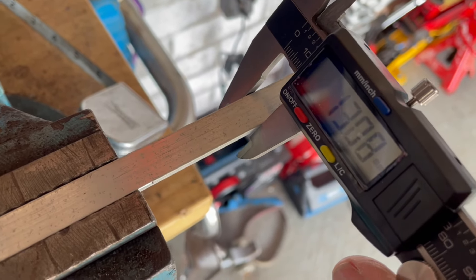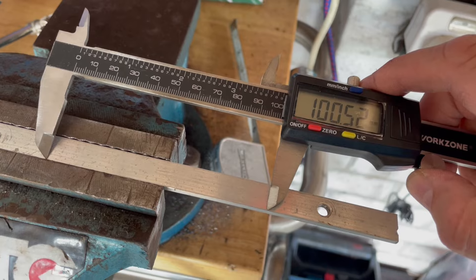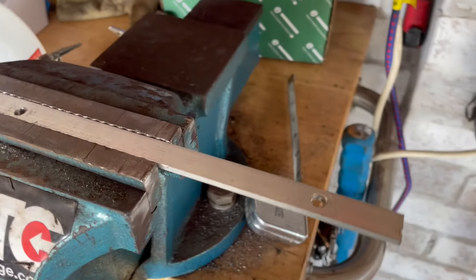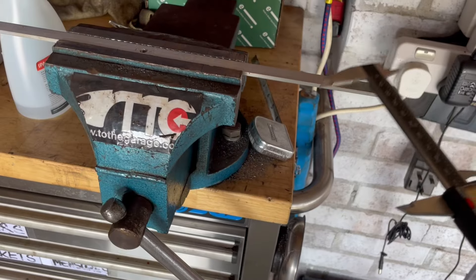If you're even slightly handy at home, make your own gadget — and I'm not going to spend long on it because it really is that simple. Step one: get yourself a strip of aluminium. Mine is 13mm wide, but anywhere between about 10 and 15 is fine, and mine's 3.5mm thick. You need about a hundred millimetres length — that's not a critical dimension. I've just got scrap lying around so it's costing me nothing, but you can go to your local DIY store and pick up a piece of extrusion. Anything much more than about four millimetres is too thick and will jam your door mechanism.